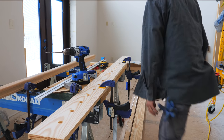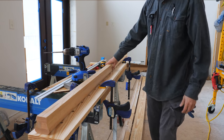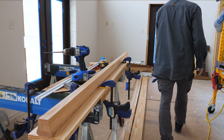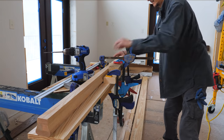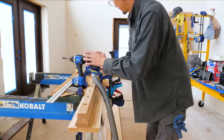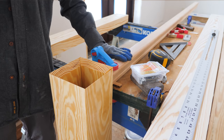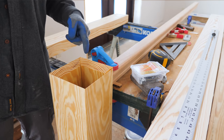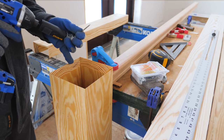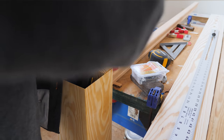I'm going to do the handrail now. This one is a lot more challenging because I have to drill and it's laying on a round part, so I made a little jig to hold this thing tight. That sucker's not going anywhere. I've got the rail propped up to the proper height and the post is set against it — everything's clamped — so I'm going to try and pre-drill for this. This will be a middle post, so I'm going to try and get two screw holes in here. I'll try to do all this before I stain it, so I know where I've got to go.